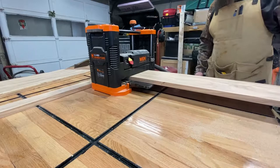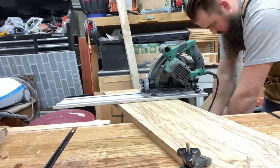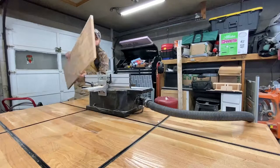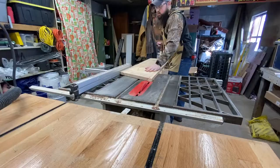We're going to get started with this beautiful piece of spalted ash. We're going to plane it down just to get it dimensional and so it's an even thickness on both sides. Using the track saw, we're going to cut the top at a 20 degree angle — this is where the top of the lectern will actually sit. Then we're going to take it to the jointer and make sure we get a 90 degree perfect square corner.